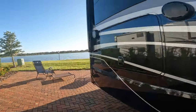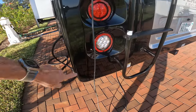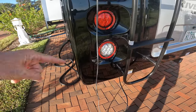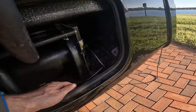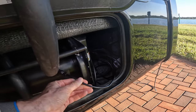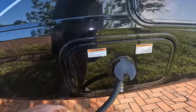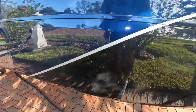Back over here I will put a hole right here and install this waterproof Cat5 connector. Then I will run a cable from the interior all the way through the other side — I've already run that cable. Here is a shielded twisted pair cable, UV- and burial-rated. I've covered the end with some electrical tape just to protect it. The idea was originally to bring it down through this way and run it underneath, but inside it wraps around and there's a clear shot — you run a fish tape and you can drag it all the way through.